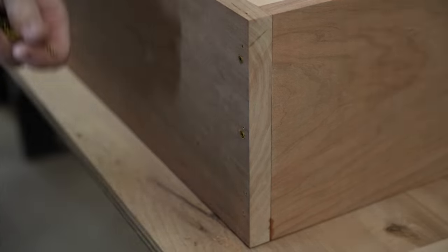And I built my head casing assemblies. So you have the head casing, the cap trim, cross head strip, and I just laid those out on a flat piece of work surface and just brad nailed the top and bottom piece. Really easy. I think I forgot to film that. Have my door assembly, just my door jams ready to go. I'm back over there in that door opening.